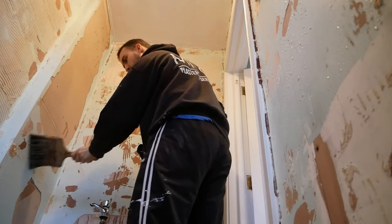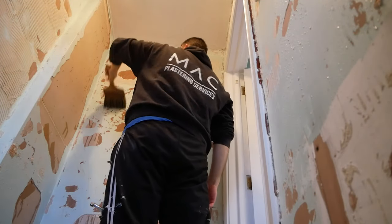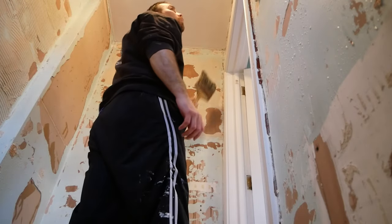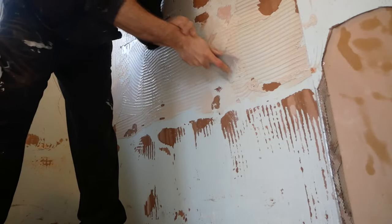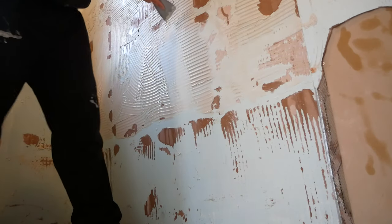Whether you're a plasterer or not, you're probably going to need a plasterer regardless, so you will be paying for one. This is where the money saving comes in — by doing this, I'm saving myself having to undercoat and wait for it to pick up before putting a skim coat on. If you do this before the plasterer even arrives, he already sees a blank canvas. You're literally killing a lot of his preparation time and saving money. It also saves on materials — no need to buy undercoat plaster such as bonding or hardwall.